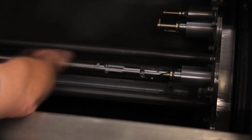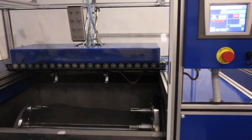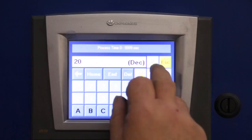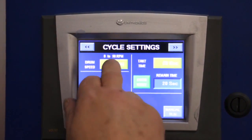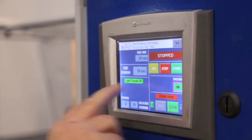Processed products are mounted onto the tooling heads. The main turret is rotated, as well as each individual head. This ensures that each part is thoroughly and evenly de-burred or polished. The machine uses a PLC and touchscreen controller. Parameters like speed, direction, tack time, and recipe settings can be adjusted.